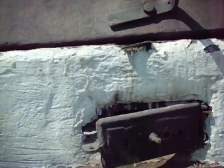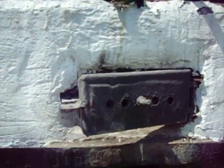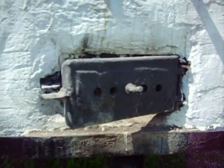Down here you have your air adjustment intake, of course, and you just move it back and forth to adjust how much you want to stoke it up or stoke it down. As you see here, this is removable. It's 3-inch muffler piping. Here's the grating on the inside. It's angle iron grating with holes in it for the draft that comes in through the door. You can just barely make that out. Now, nice thing about this is noticing how thick it is. This has a 1.5 inch plenum around the whole grill.